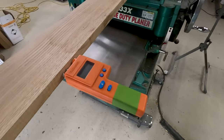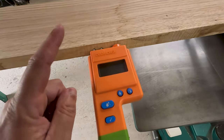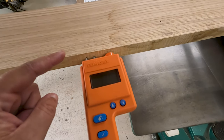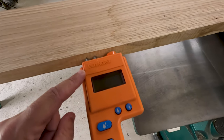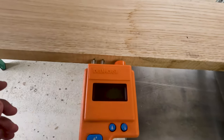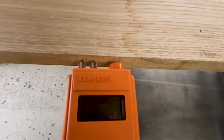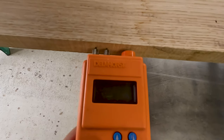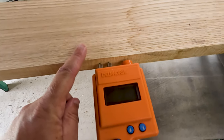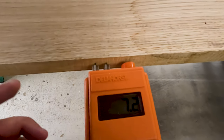I got the moisture meter out to check the moisture — this is my Delmhorst meter. If you have a sawmill or if you're a woodworker, I advise you to get yourself a Delmhorst moisture meter. I bought this one several years ago; you can get them on Amazon, there's a link down below. This is not sponsored by Delmhorst, but in my opinion they make the best moisture meter on the market. We've got the temperature set at 70, which is the universal temperature for lumber, and the moisture reading is set at 32, which is for white oak. The moisture is 7.2 percent on four-quarter white oak — that's what you want right there, friends. I'd have been happy with anything less than nine, but 7.2 is a win.